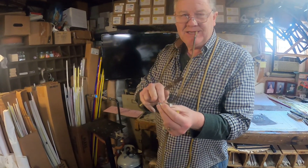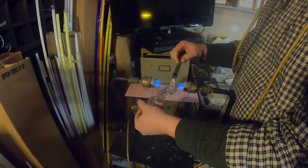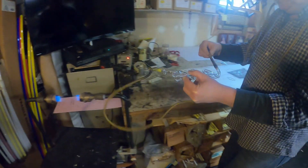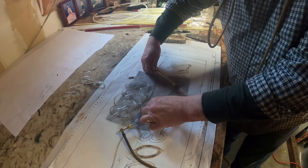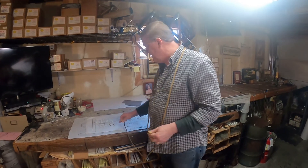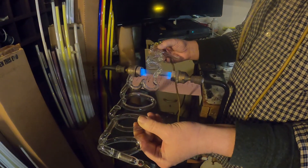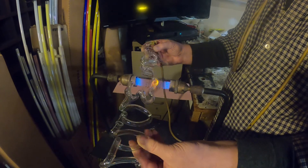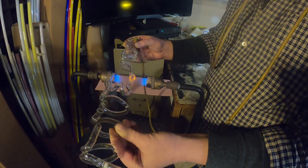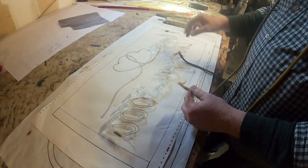On the other end, I'm using one that's not tubulated, so we're going to be using an electrode holder so I don't burn my fingers. Now that we have our electrodes on, we're down to three pieces. I'm going to put all three pieces together and then we'll take it over to the manifold and get it ready to fill with neon gas. And remember, all these little jumpers will be painted after we're finished, so you won't even see those.